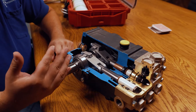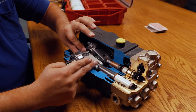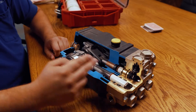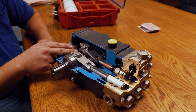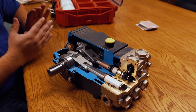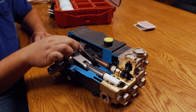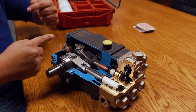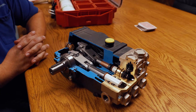If you've got a stuck check valve, there's always load on this plunger in one cylinder, so it never has the same motion and it doesn't lubricate well. A stuck check valve can actually take out the oil end of your pump because the connecting rod isn't getting the spacing it wants for load — it doesn't want to be under load when it's pulling backwards to lubricate properly. The shaft inside times these three so they're going forwards and backwards together, moving the water.